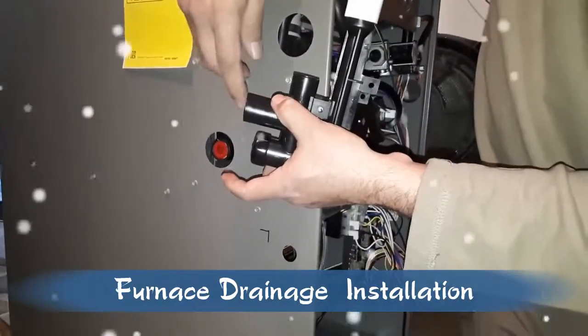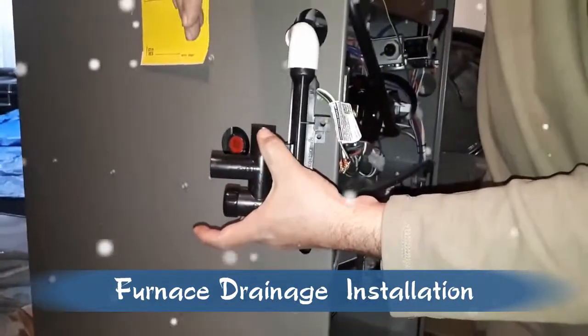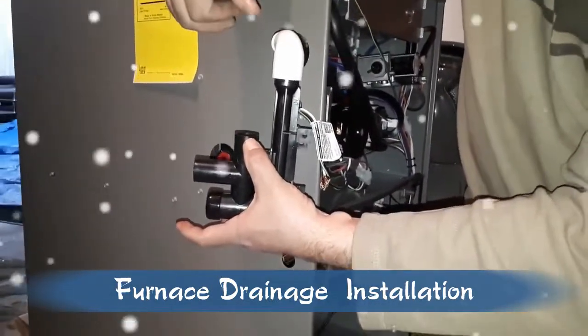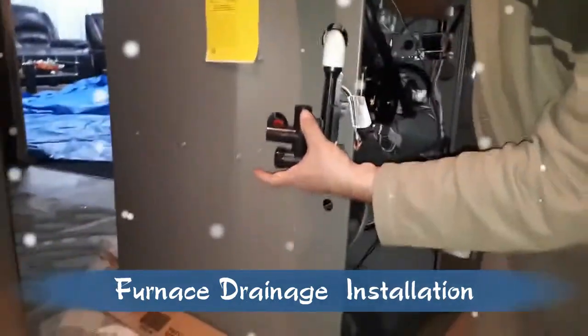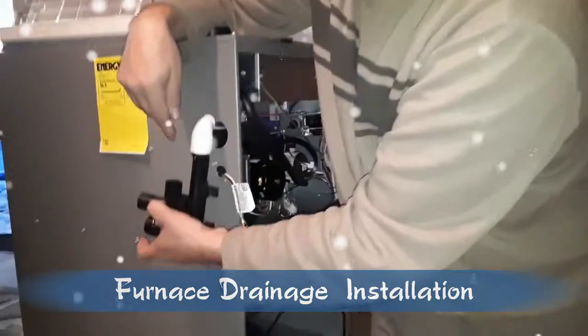We connect with our pipe, half inch PEX, you go through it, and it's on vent. We continue it a little here to make it flow easier. Yeah, we can probably come up with a T, another T, because we have a humidifier. Or the humidifier, because it's close by, you can directly connect it to the floor drain. This one we still keep nicely for the vent.